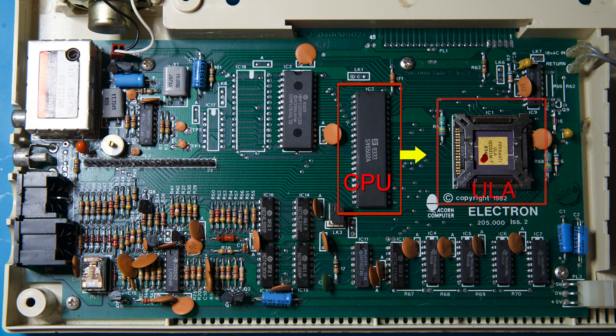The CPU and ULA have to take turns when accessing the RAM. The ULA, short for Uncommitted Logic Array, was designed so that multiple tasks can be performed on a single chip instead of multiple chips, which would increase costs on the machine. The ULA is in charge of sound generation, graphics output, tape data input and output, ROM paging, and the interrupts.